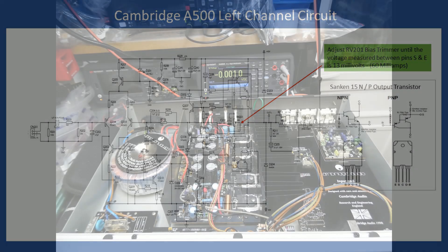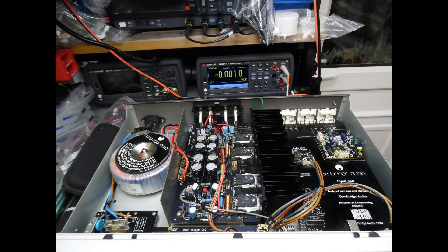Once that's done, make sure all user controls are noise-free. Simply spray high-quality contact cleaner such as DeoxIT into the potentiometers and work them backwards and forwards multiple times. With speakers connected you may hear scratchy or poppy noise — let it do its work, then recheck and apply more if needed until completely noise-free. If potentiometers are stiff due to dried original lubricating grease, working them back and forth will usually free them quickly.